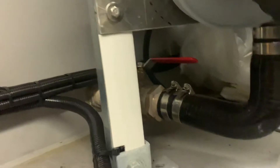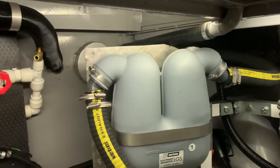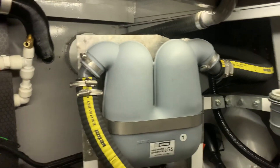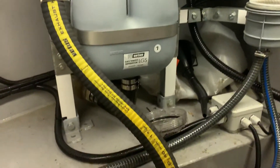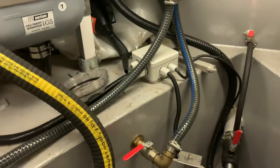Then that goes up to the gas-water separator — there's the model number — and that has to be above the water line. You've got the water coming out there below the water line, and then the exhaust comes out through that pipe above the water line. That's it really in a nutshell. I wouldn't say I'm an expert on how it works, but it's all detailed in the installation guide of the GLX unit.